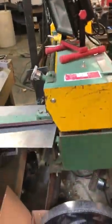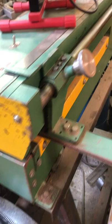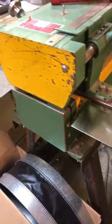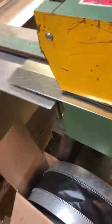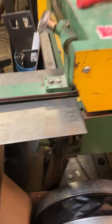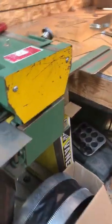Here I've got my slitter shear. You put a piece of sheet metal in it, set the fence at the width of the cut you want, put it through — it slices it down. The metal's only 10-foot sheets, but it would obviously cut infinite length.